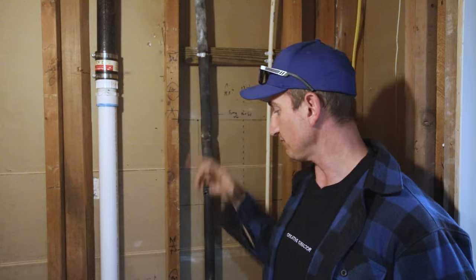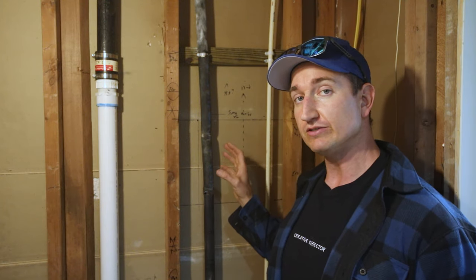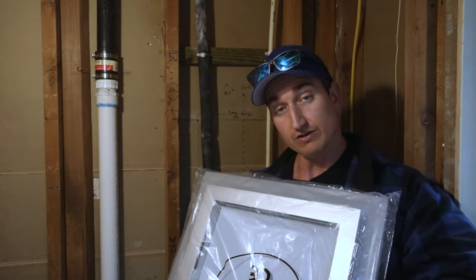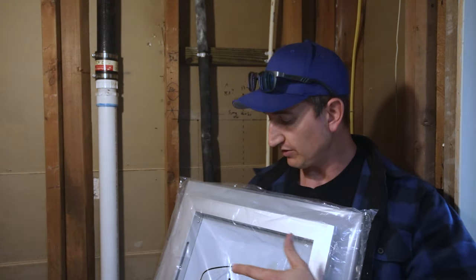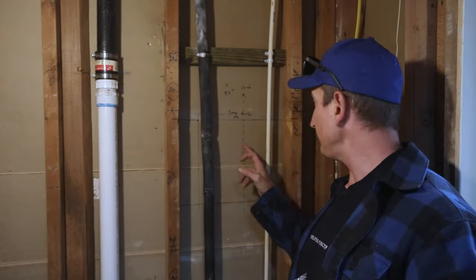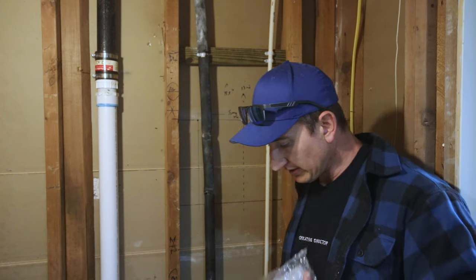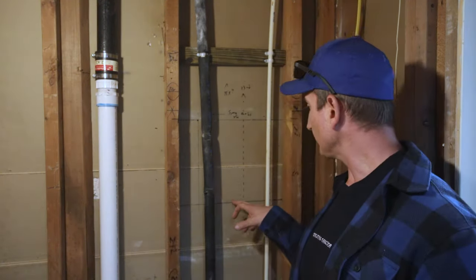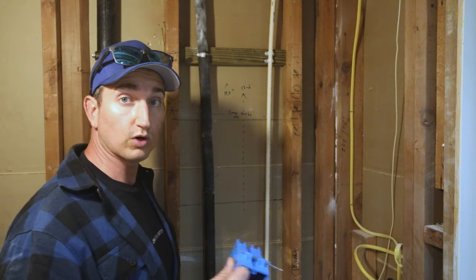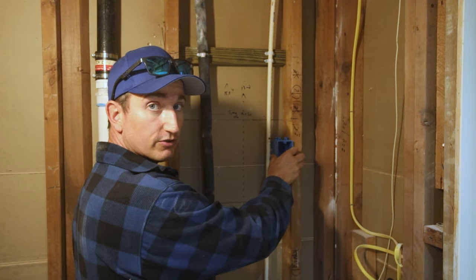I figured out my height and marked the bottom as well, so I know the mirror will sit within the space. I need to put an outlet box in here without it interfering with anything. Looking at the back of this mirror, I found a 13 and a half inch space — half of that is six and three quarters. I measured over six and three quarters from center to find where the outlet can go, and I know that anywhere within this marked box I can put my electrical box. Fortunately the box lands right on a stud, which is very convenient.